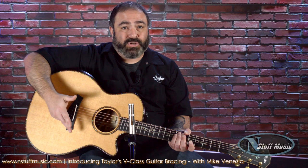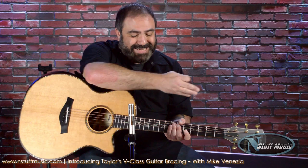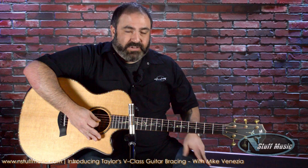What that does is output notes in a more orderly fashion. Because there's stability down the center line of the instrument, we are increasing our sustain. But by increasing the flexibility on the sides with that rocking motion, you're getting volume. So in essence, every note along the entire fingerboard has its own power and its own sustain — it rings out longer, and all these notes ring out truer as well.